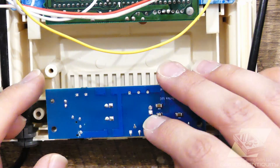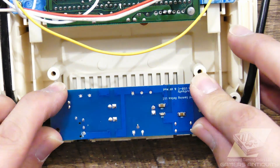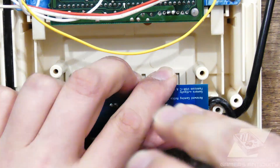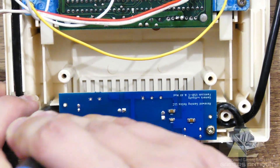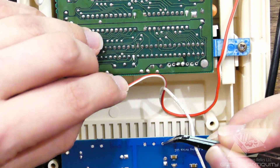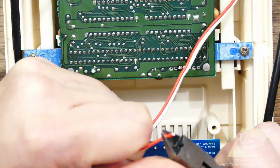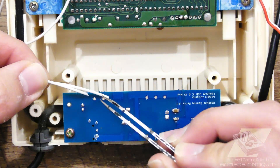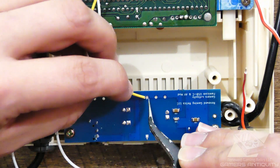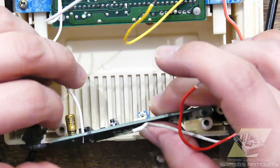We're going to fit the board in place to get an idea of the length. I'm going to show you the way to route the cables so they don't get in the way of the cartridge detector. The switch will be connected to the V-bus via on the mod to via 2 where the ribbon cable was. The cable from the CPU will connect to the CPU vias on the mod, while the cable from the PPU will go to the via for it here. The last remaining via on the board connects to pin 1 where the ribbon cable was, for ground.